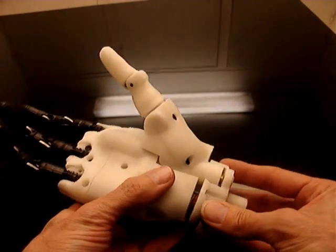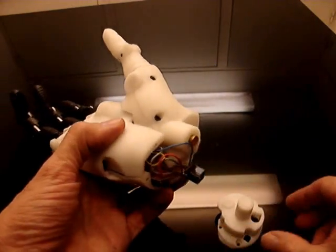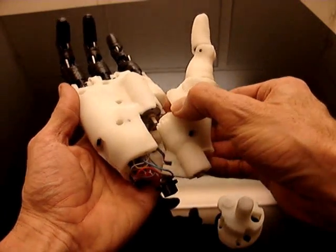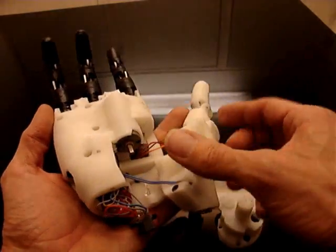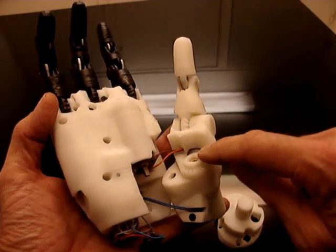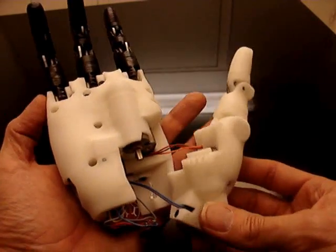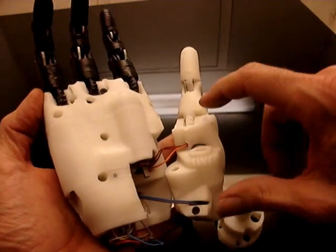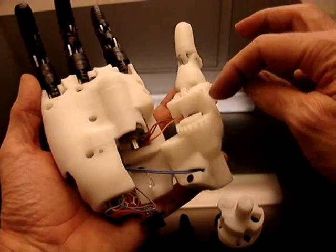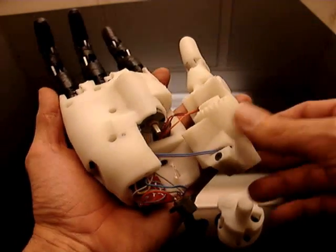I'm going to show you how the inside is done. Here I'm taking off this part, and there's the thumb that comes on the motor — the motor over here allows the rotation of the thumb. Inside the thumb you can see there's another motor to actuate the thumb itself with the gear. All the wires have tubings inside the printing, so you just put the wires in and they follow the tube to come out at the right place.